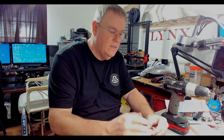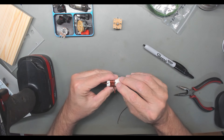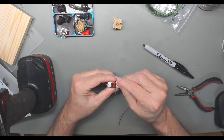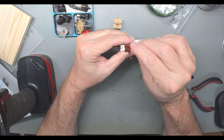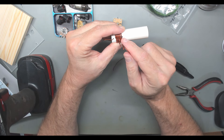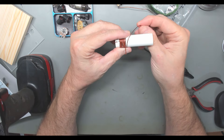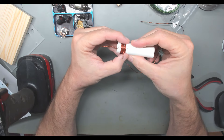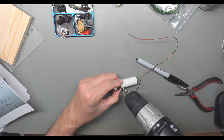Here's where we are. I didn't stop at 8 or at the 12-tap because my hands were just too full to show much. I've got my wraps on here and I'm up on my 15th one. I figured out where the 15 is, backed off this roll, and marked with a pin where I'm going to drill to put the wire through and back out. I don't want the drill bit to tear up the lacquer off my wire — that would be bad. So I'll give myself some room and drill my hole right there where that mark is.